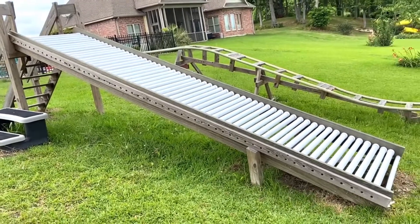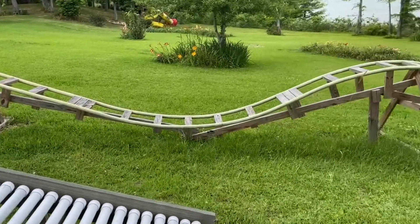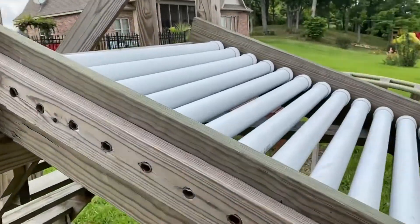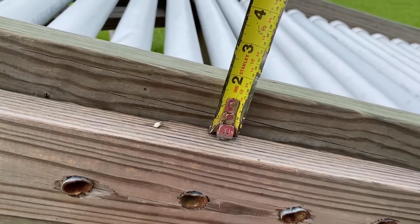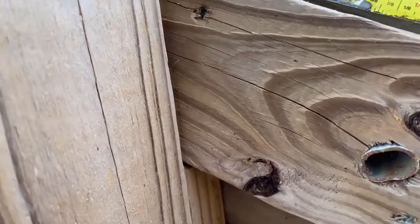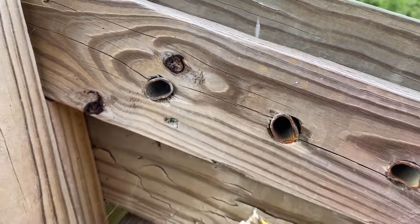This is the roller slide I've already built at my house, but I'm building another one now for the church, and that's the one I'm filming. You can see my roller coaster over there, my tree houses and stuff, and the swinging bridge. I wanted to show you where I get these measurements from — this 2x4 goes on there one and a half inches below the top of the 2x10, and then we're going to have our first hole six inches from the top, with each hole three inches spaced down the center.